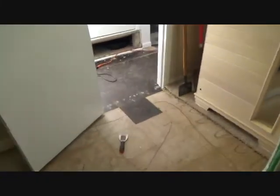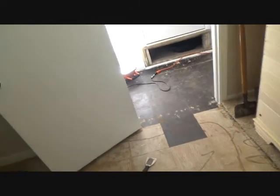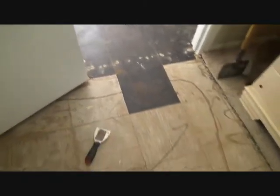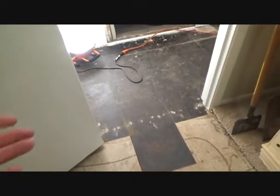Speaking of staining floors, are there different ways to do it? Oh, of course. You know, you don't have to use a Hudson sprayer. There are other techniques. They talk about putting it on with a sponge, wiping it on with a rag, but whatever way you do it, you have to continue it. And still, I wouldn't rag this one room and stop it at the door and then start ragging the next day beyond the door, because if you get it too thick or too thin, well, if you get it too thick, you can't thin it up.